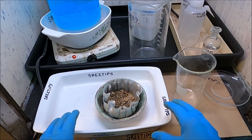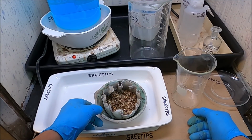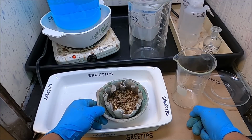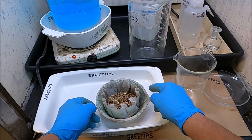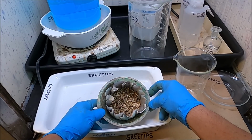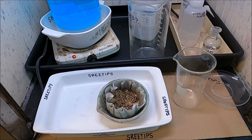And in the past, I've skipped the incineration part of the process here, and whenever I skip incinerating at this point, when I've got the foils recovered, I always end up with less of a yield than I was expecting, and the gold is dirty when we get it in solution and precipitated. So I don't know why that is, but I'm going to incinerate this material before we go to the aqua regia.